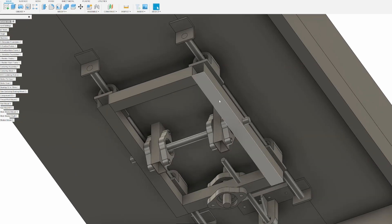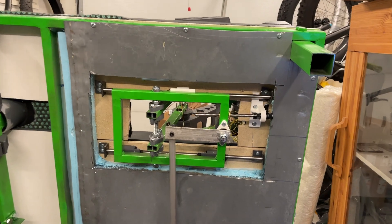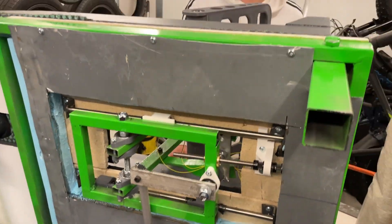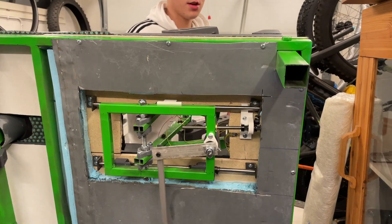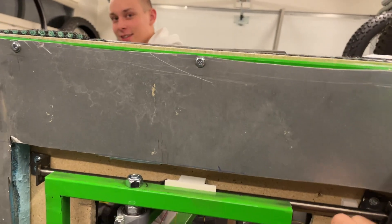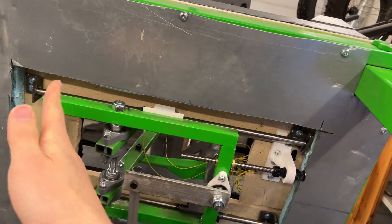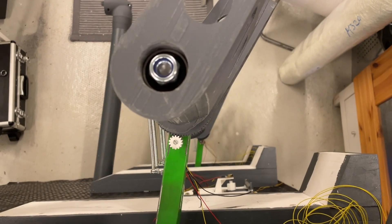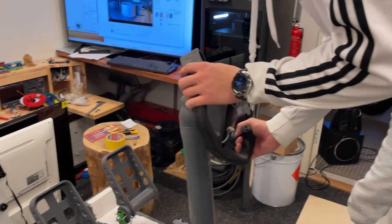The mechanism was 100% custom made and designed to be very functional and realistic to the real plane. In our design you can adjust the distance of the pedals from your feet independently on both sides. They are also connected to each other so that when you push the pedal axis on the captain's side, the first officer's side moves with it — achieving a realistic effect like in the real plane and giving better input feedback.